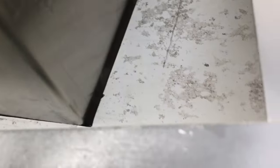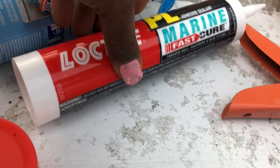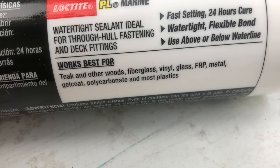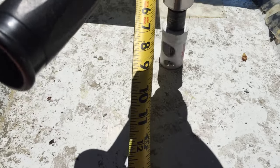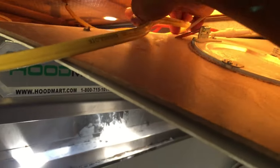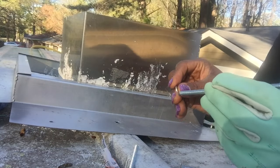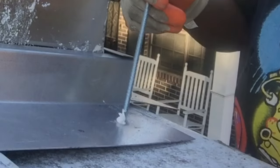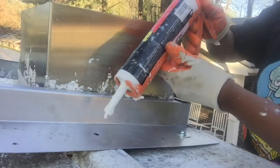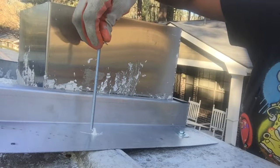After I put the foam in, I'm going to put this marine waterproof caulk on there — watertight seal, 24-hour cure, watertight flexible bond, use above or below the waterline, so this is perfect. Here I'm drilling a hole to have a place to stick the wires through to connect to the exhaust fan. That hole right there is for the fan wire, so I've got to fish it up through. I also have these quarter-inch thick, six-inch long bolts to hold my curb plate in place, and I'm adding marine caulk with a bead underneath it around the hole I cut. This is how I got the curb piece bolted down.